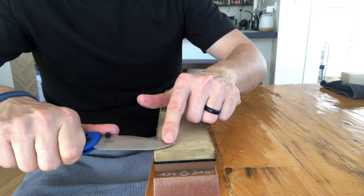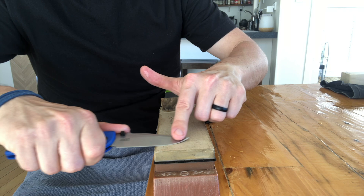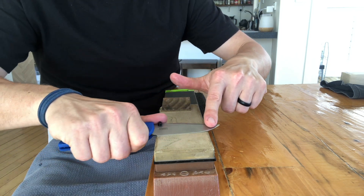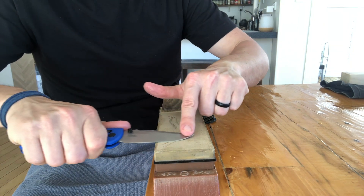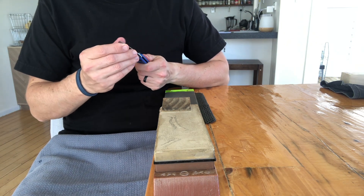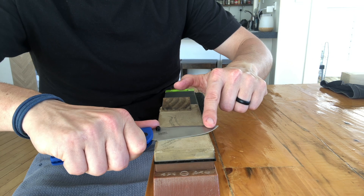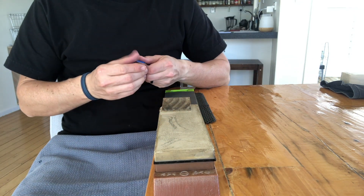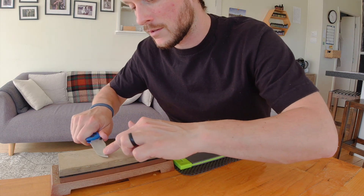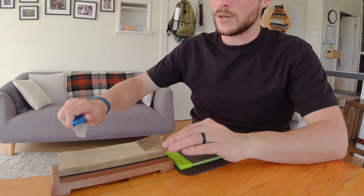I've removed the burr without flipping it too hard to the other side, so I'm switching to my King 6000 grit stone — which is feeling really nice because I just flattened it with a Nagura I got in the States. I've got some fun new stones to try out. I'll be Victorinox-testing them first, but I'm really excited to share results and try more dual grit combinations. I've got a small but definitely identifiable burr — I'd actually like a little more in the middle where the pressure gets spread out.